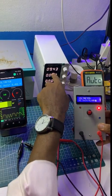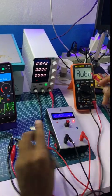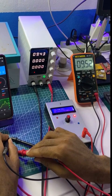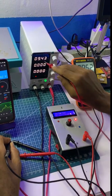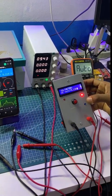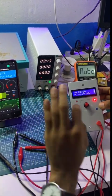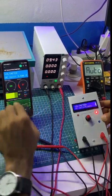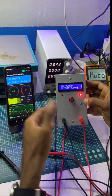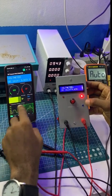The system automatically detects the DC component and interfaces the reading in real time. We have 9.5 and 9.4, which is about a 0.1 offset. Comparing the two readings: 9.52, 9.43, and 9.5 — which is essentially the same in terms of accuracy. This 0.1 offset is still fine for a multimeter designed using discrete electronics components. The same is applicable to the web interface — what we have on the screen aligns with what we have here, including the internal battery graph logged over time.